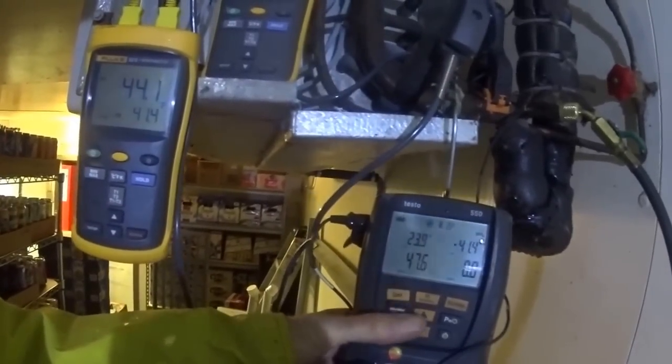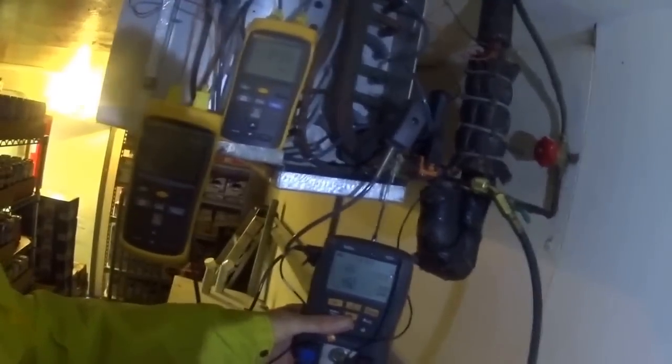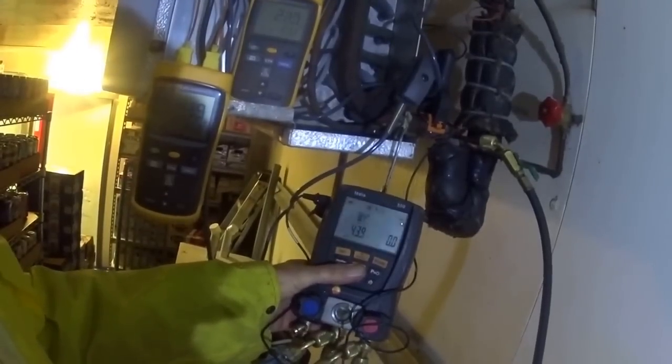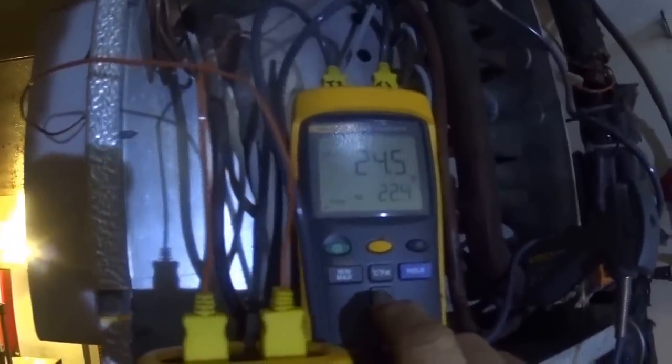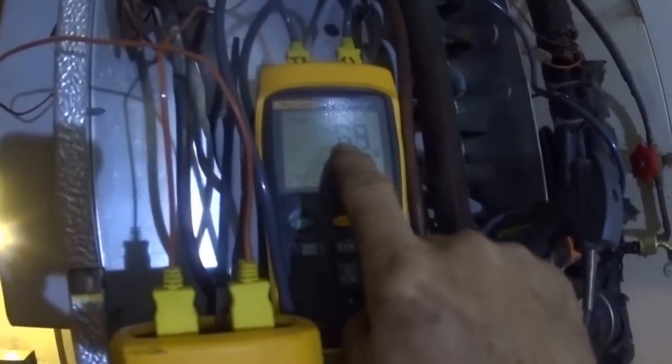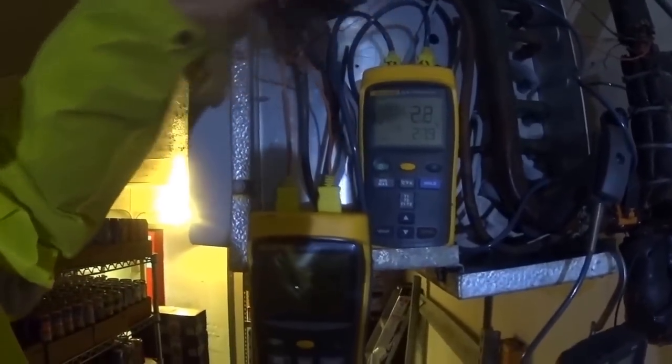We got 47 which is closer to what we should have, absorbing heat into the lines now. My superheat is 8.3 which is low. The coil — it's about to show my superheat. The valve's hunting right now — we're hunting. It's a little bit too low; I want to raise that up a little.